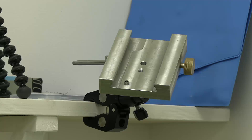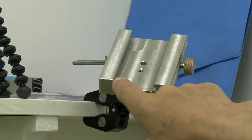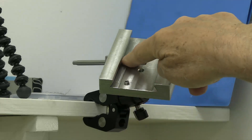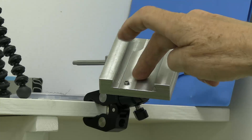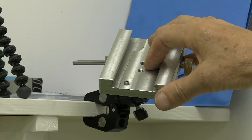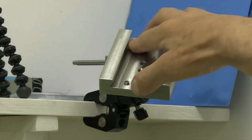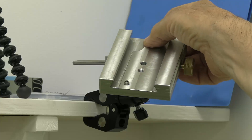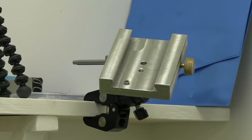I've squared that up and I'm about to use my 60-degree dovetail cutter to cut the dovetails. This is actually only the second time in my life that I've ever used a dovetail cutter. The first time was when I made this, which is just a little mounting for the video camera, made of aluminium. As I used a dovetail cutter to cut this dovetail along here, as it got to this end, it started digging in to the base. I felt sure I had milled it absolutely flat. But then I realised that on a 60-degree dovetail cutter, most of the force is downwards, trying to pull the dovetail cutter out of the collet. Either I hadn't done the collet up tightly enough or I hadn't locked the column or the quill properly. So that's a lesson — with all cutters, but particularly dovetail cutters, lock everything up in the Z axis tightly. We'll try that this time.